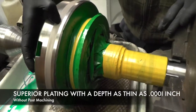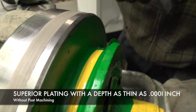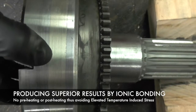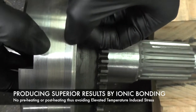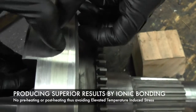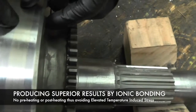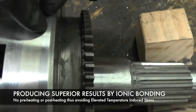This is the area where that groove was worn into the part. The nickel has filled that all up and now it's ready to be taken over to the grinder to make it all one flush surface again. The nickel plating filled in the groove that we machined out — the groove that the seal wore into the part. You can see the sides are flush with the original part. It was ground down, just kissing this diameter to keep everything concentric. There's a very slight bump because the nickel and the part won't be perfectly concentric, but they're very close — plenty close for this seal fit.